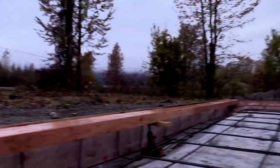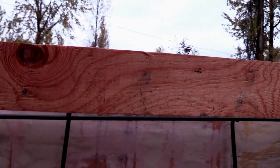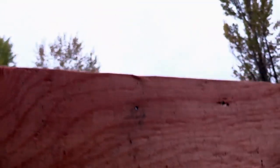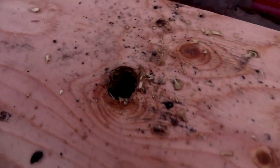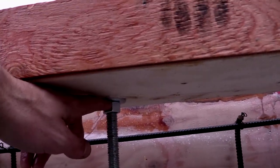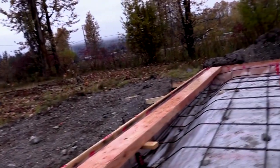At first I was kind of stumped, but my guy helping me with the concrete gave me the idea to build these big beams. I was just going to try to box something out of plywood, but underneath that is actually solid 2x10 with a 2x6 and a 2x2 all pieced together. There was quite a bit of sag, so he had the idea to get some ready rod and slam them into it. I drilled a hole on top, brought the bolt up with a washer on top to get them to level, and anywhere you've got sag, throw one in. I went with three and got her tighter. I still have a board on the bottom I need to pop out before we pour, but that's how I solved that problem and everything else is good to go.